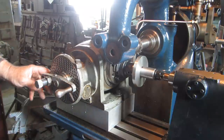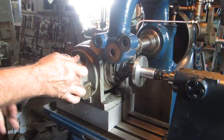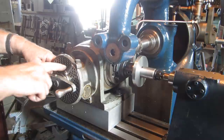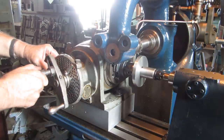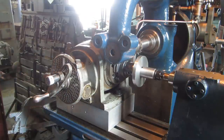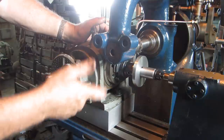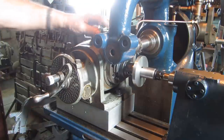again, another 15 holes. And there are plenty of ways to screw this up. I like to move this just before I make the move. Some people like to move the gauge just after they make the move, but that's basically where you're at. And if you do that 64 times, each time you cut a tooth, you'll come back around exactly to the last tooth.